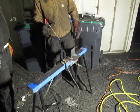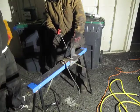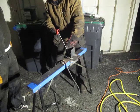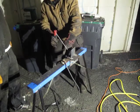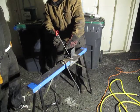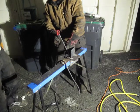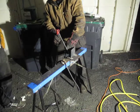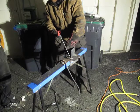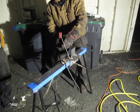When you're stick welding, you're holding the stick at 45 degrees to the weld joint. This is a T-joint, so you're 45 degrees to it and you have about a 20-degree travel angle — you're not 90 degrees to the plate. You've got a bit of a travel angle and the entire stick is consuming. As it's consuming, you want to feel it lightly touching the steel, or about a sixteenth to an eighth of an inch off, just feather-touching the material as it disintegrates into itself.